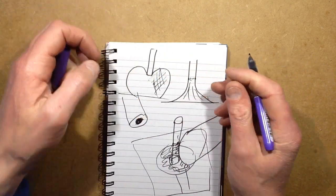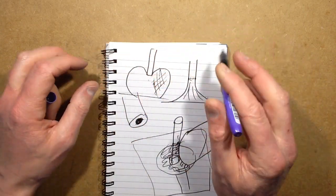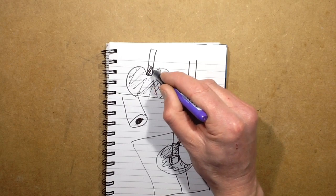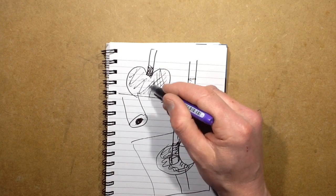That's the sort of joint you're going to get if you carried solder over. If you melt solder onto the iron, all the flux boils off, and then you carry it over, there's no flux there to actually mate it onto the leads. This can also happen if the leads themselves are tarnished beyond recovery, and in that case you'd have to clean the leads and try and reflow it.